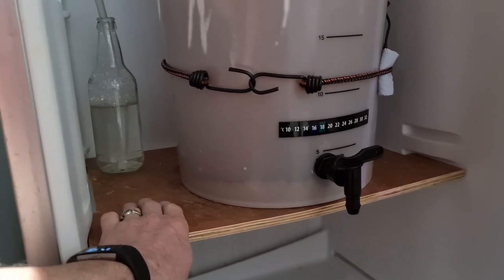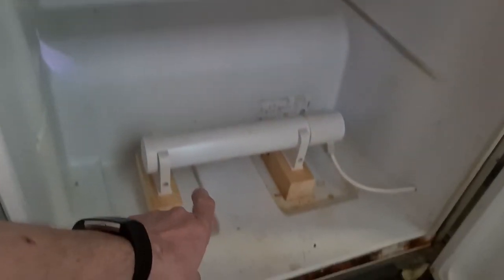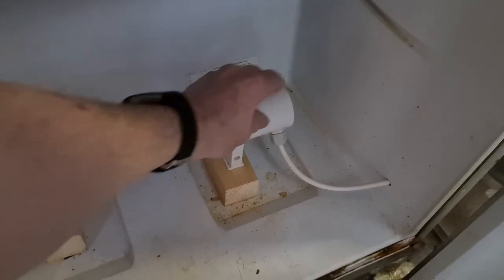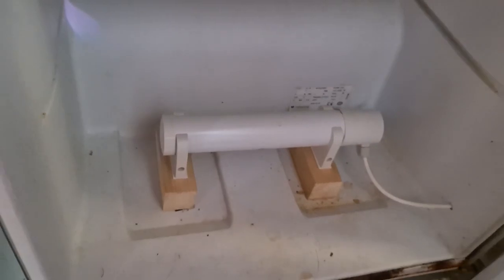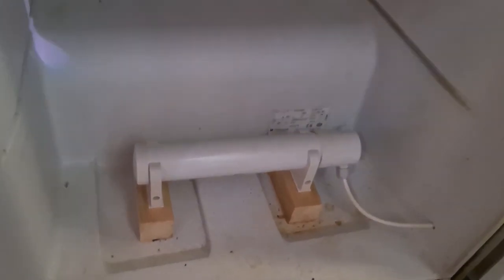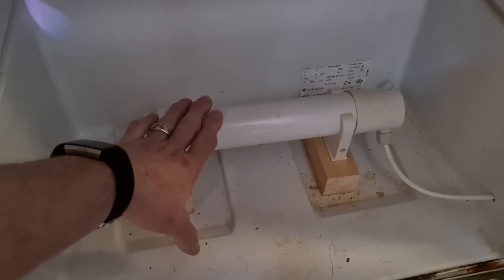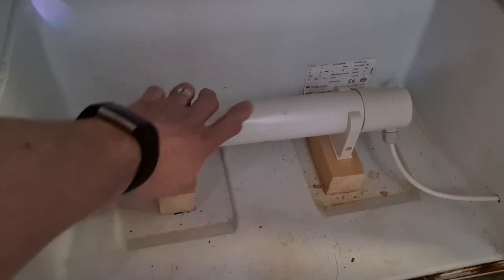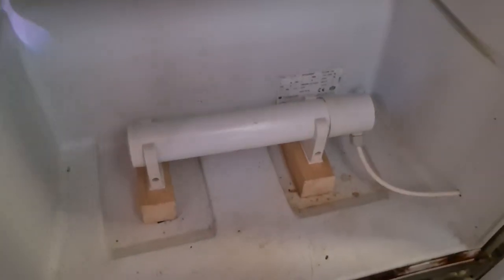In cold weather you don't really want a fridge to be a fridge if you want to keep the temperature up. So there are these small greenhouse heaters - depending on where you get them from, Tool Station they're about 15 quid, eBay they're about a tenner. Get the one without the plug, and without a thermostat, because you don't want a thermostat cutting off at about 10 degrees - they're designed for greenhouses, you want one that's going to get quite warm.